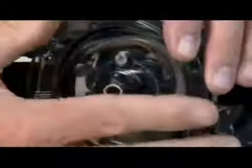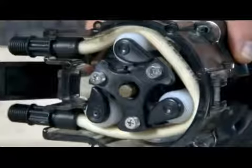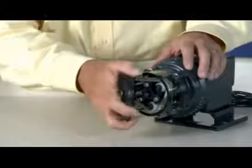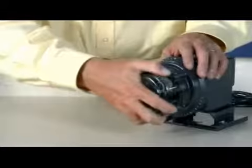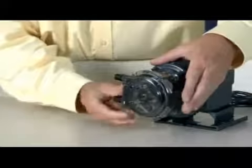Hold the feed rate control securely. Use the cover as a wrench and quickly snap. Rotate the roller assembly clockwise to expand the roller assembly. The tube will be pressed against the tube housing wall. Place the tube housing cover feet first on the tube housing. Affix the front latches to the cover lip and then press the latches back to secure.